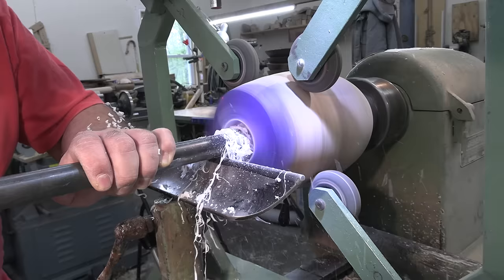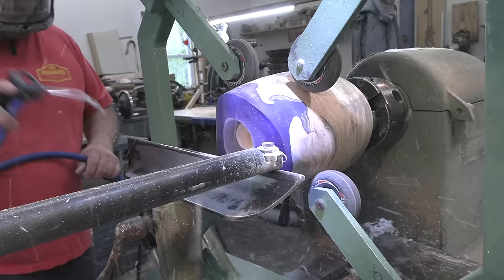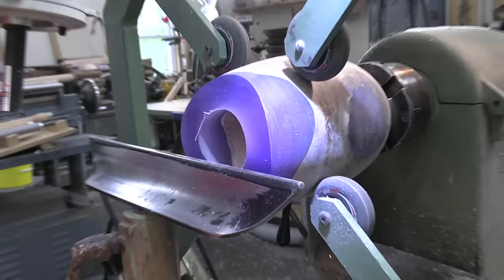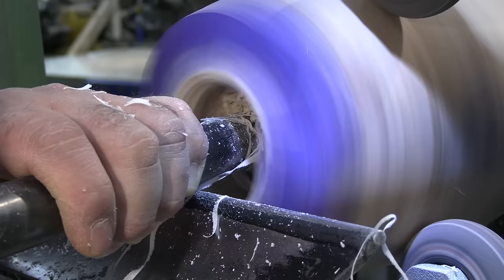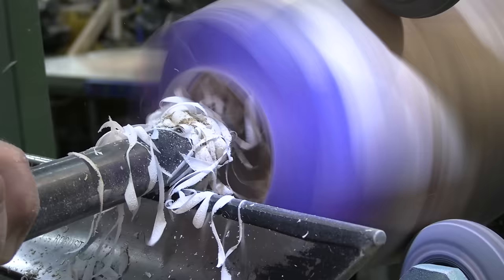As you can see, I haven't gotten around to changing the design of the steady rest. With the captive system here and the laser, if you're new to my channel, the laser can hit on the steady rest at the top. So I just want to lengthen those sidebars, and that way it doesn't interfere with the use of the laser. It wasn't really a huge factor here because this vase, I'm not going to say it has straight walls, but as far as hollow pieces are concerned, this is easier to work on than some of the other hollow forms that I've done in the past.